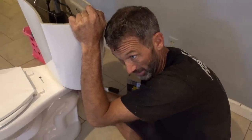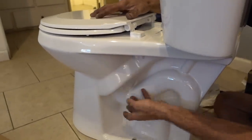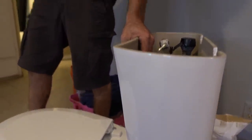There's technology in toilets. This is the trap — it holds fluid there, and when more fluid gets in, it pushes the fluid over this hump, which is what moves everything down. They have a toilet you can fill with golf balls and flush — all the golf balls go down, because they spent time and technology on the flushing. The more expensive the toilet usually has to do with how much they spent on flushing applications. All our toilets are 1.6 gallons or less — I think they're actually 1.3. Back in the day they were 2.0, so you could take a big one and it'd go right down. Nowadays it's like a 2 or 3 flush deal sometimes.